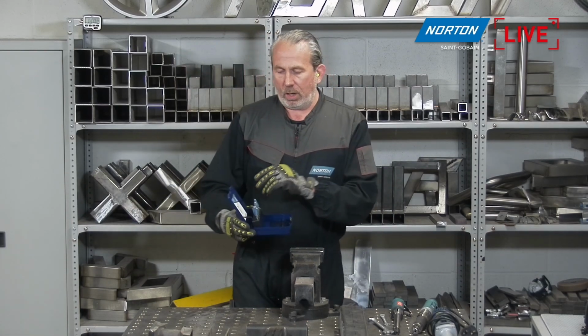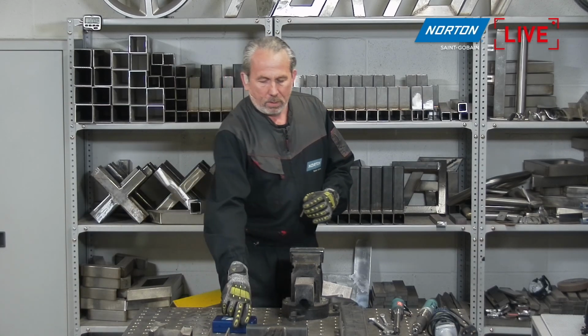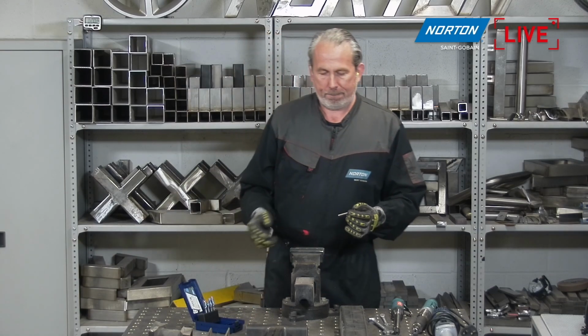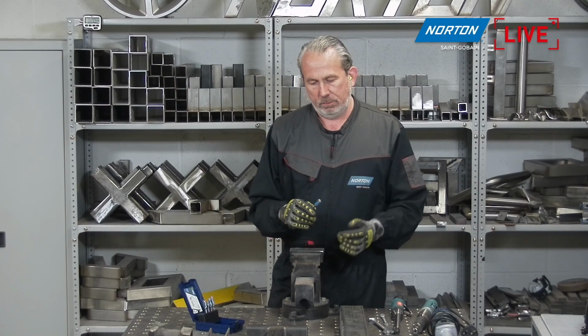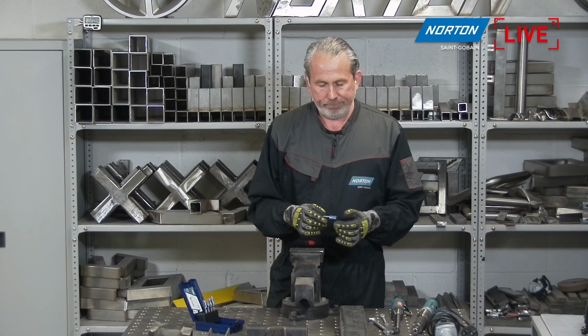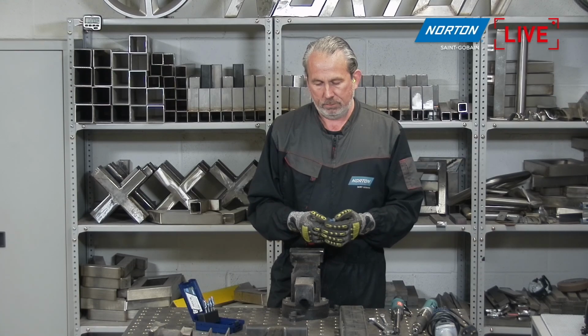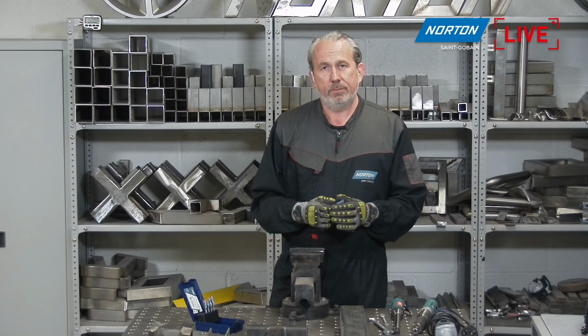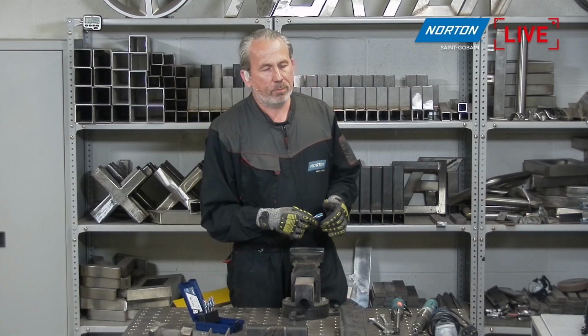which we will go through now step by step. Okay, so we might as well start off with the cylinder, Paco. How about that? Are you okay with that? Yeah, that's perfect. One of the main advantages is that they have the double cut and also the new string cut in Norton, so you can work in both directions. In the old-fashioned carbide burr you can find in the market, you can only work in one direction. You go up and down, and with this double cut and also the string, you can work in all directions, right side, left side, without stopping. Then you will work much faster, and you will remove much more material.